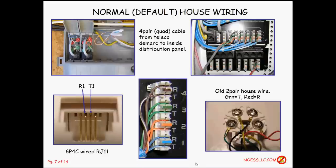If you have a really old house — at least 15 to 20 years or more — it's possible you have older wiring: just two pairs, a green and a red. The green is the tip and the red is the ring, making line one. If you had a second line, it would come in on the black and yellow. So you could have two phone lines with the old wire, but that's all. Very often these wires were just screwed down onto the terminals. If you have a newer house, you'll probably have quad, giving you four pairs and a lot more flexibility.